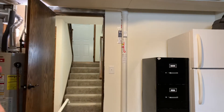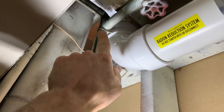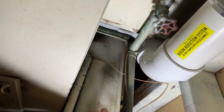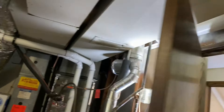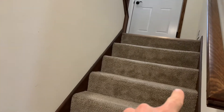So as you can see, we've got our main suction point here. Our pipe runs up and over, and what we've got is a 90. Then we've got another 90 where it turns and faces that direction — we're trying to get up behind the refrigerator in the chase for the B vent for the water heater. So that 90 up there actually has a two inch heel on it. So we've got one of these right up there, and then the two inch pipe runs across and then it drops down into this area for our suction point.